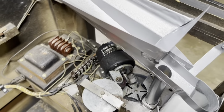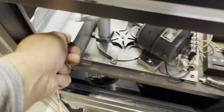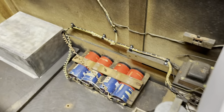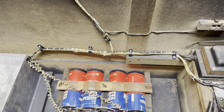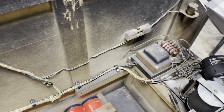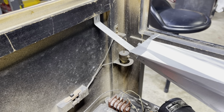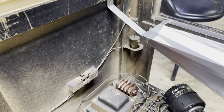Went over the mech. Here's your coin chute now, and we have a coin box down here at the bottom. So, big improvement from the way it was. The last thing you want to do is come inside here and look at a bunch of crazy wiring, like extension cord wire and stuff. And we also had other funny things where the tilt mechanism was completely bypassed, so that was fixed, and it's very, very sensitive now, so it'll definitely stop the cheat. So there you have it.